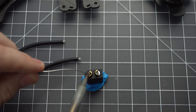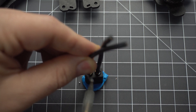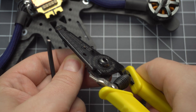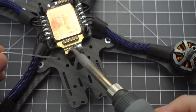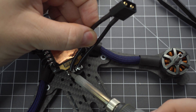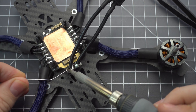Next let's do the power lead. Here I use some 16 gauge wire and it's really helpful to have some blue tack — that way you can hold the XT60 down while you get the wires soldered up. The trick is not to fill the XT60 with too much solder, but just enough so that when you push the wire in it doesn't overflow. After you've got that done just put some shrink tube over it and you're all set. Next we want to solder the battery lead to the 4-in-1 ESC. Apply a generous amount of solder to the pads — I found it a little easier to solder to the top of the pads. You want the battery lead to go out through the side of the quad rather than the back, so one wire will be just a little shorter than the other.